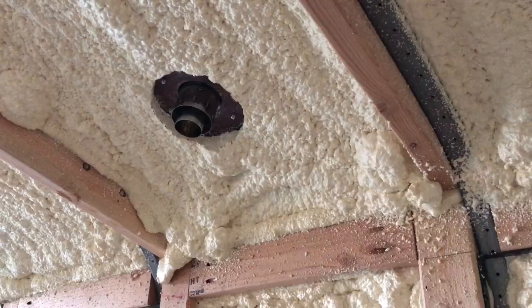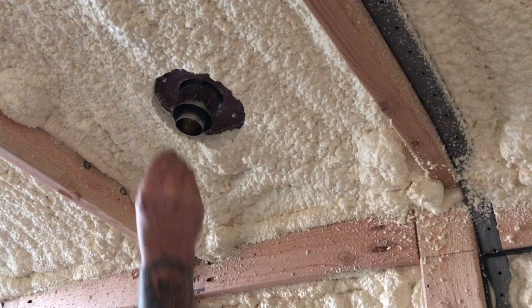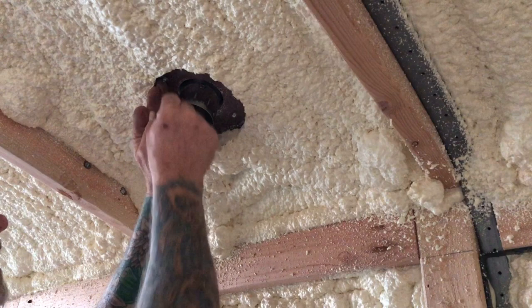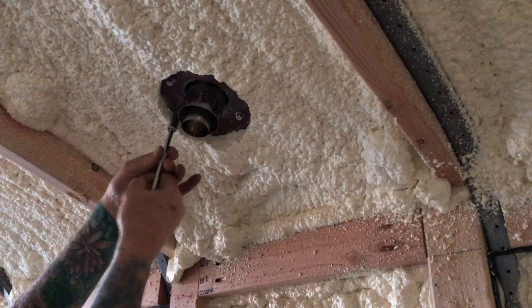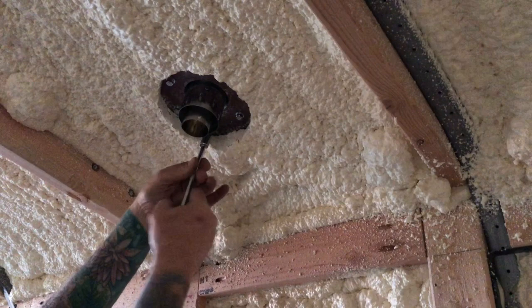I'm going to put it in there with quarter-inch bolts. I went up there and drilled all the other holes through — it was made to go on a wood deck and it had the rubber grommet underneath, so I just drilled it out. Now I'm going to bolt it down instead of screwing it down, and I think when I pull the bolts down it'll squish out that rubber enough. I went to get Shelly to hold these, but the rubber grommets are holding them so I'm not pulling them all the way down all at once.